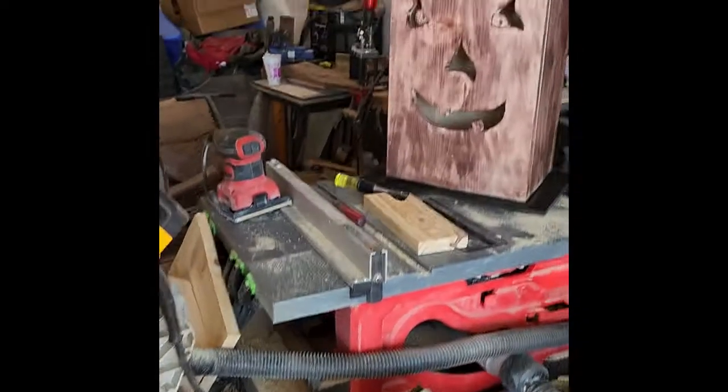All right, I'm back, and the little miss went ahead and decided to put a light coating of a red mahogany stain on the big one, which is about 2 foot tall. And then I made a small one too while she was doing that. I took a nine inch piece of 2x6 and ripped it in half, making them about 3/4 inch thick, and then I did the same thing with a 9 inch piece of 2x4. This is after I trimmed off the curved edge, and here's what we've got.